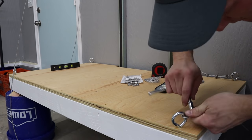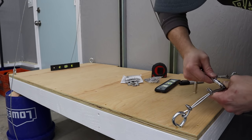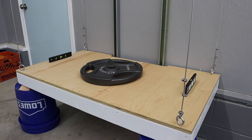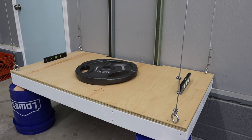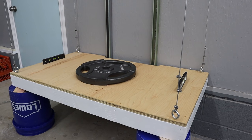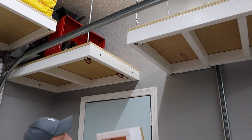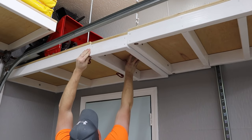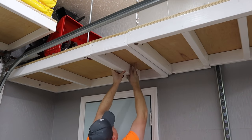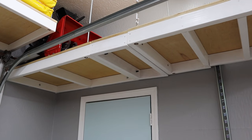I chose to go with the mechanical cable clamps so I could really feel how tight they're getting and I could adjust them and continue to add tension to them later. There are a bunch of different types of cable clamps out there — they make aluminum ones that you can just crimp and those hold pretty tight too. Once all the cables were connected, I went into the adjustment process, going up and down into the attic and adjusting the turnbuckles to get each one of the cables tight. I ended up putting a bunch of weight on this and leaving it overnight to try to help stretch out the cables a little bit. Then when it actually comes to getting the snowblower down, I needed to create a little bridge platform because my lift doesn't make it all the way over to the other shelf — I didn't want it going over top of this little man door. I drilled four holes into it and pin it up there with hitch pins to connect the lift and the shelves together.